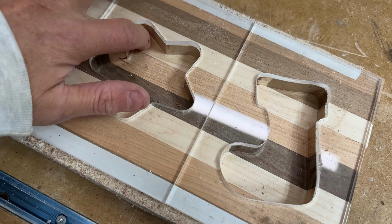I had to switch out my piece of wood that I was using because I realized that it wasn't quite large enough, because I do want this piece right here to be fully where the line is, because this part will be covered up for us to glue it together. So you will need a piece that's at least 5.5 inches so that you get that lip. But you need about 1 inch in the bottom for these 2 in order to connect with each other. So make sure that you leave that much. It doesn't matter if you go all the way up, as long as obviously you have some area at the top so that when you start to router that it's not gonna splinter. You do wanna leave probably about 1/2 inch here as well.